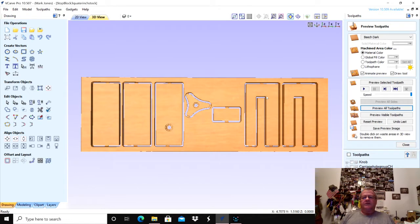Once it's done it works out real well. This is an inch, this is three-quarters on this side, and the plywood sits right in here on this side. I've created all the tool paths — I'm just using the one-eighth inch end mill — and basically we'll load it up, put your stock in there, put a screw here and here, press, and it'll cut all these parts out. Then you just need to assemble. I made one of these on my bandsaw and table saw, but I thought I'd jig it up and let the CNC machine cut it.